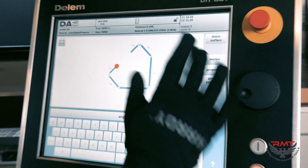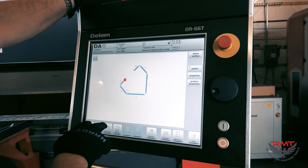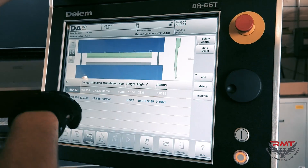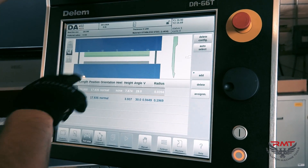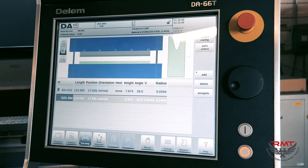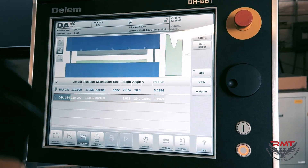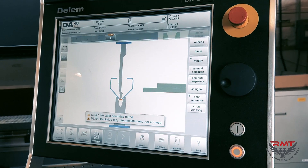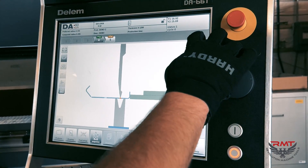This is the part we're going to bend. For the tool setup, I've got a Willa Punch BIU031 and then I've got a lower V die. You can see the opening. Now I'm going to go to bend sequence and bend this.